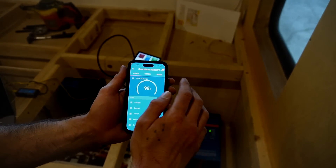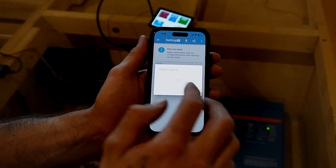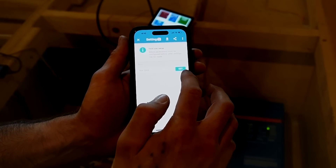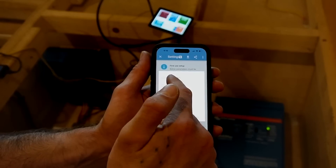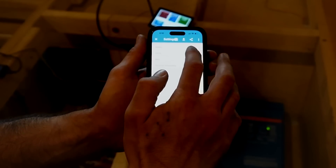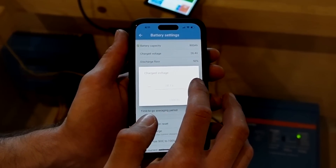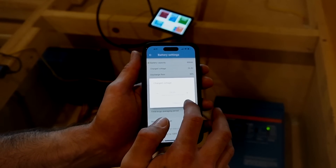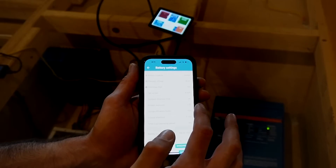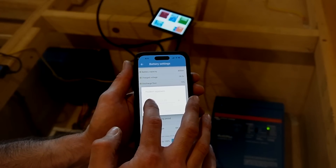We're in the smart shunt now. It's going to ask for the battery capacity — we have 800 amp hours at 24 volts, which is the same as 1600 amp hours in the 12-volt world. The smart shunt has an auxiliary input for a starter battery, midpoint, or temperature sensor, but we don't have any of those so we'll hit none. The charged voltage — at what voltage are these batteries considered charged — is 28.1 volts. I like to go about 0.1 lower than what it will charge to. The discharge floor I like to set at 10%, so when the shunt calculates time remaining I give myself a 10% buffer.